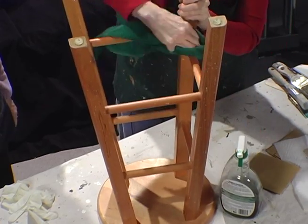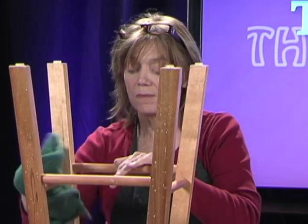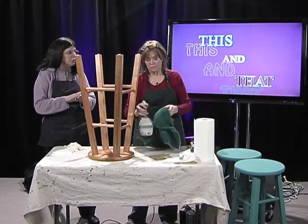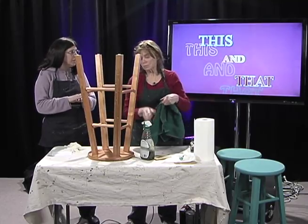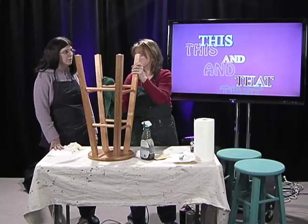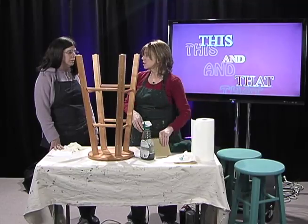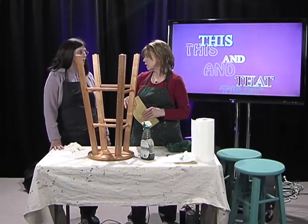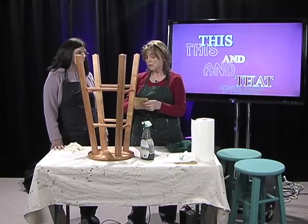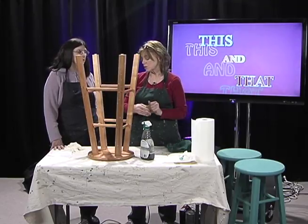It dries really fast, so then you should be able to take your sandpaper and lightly sand. There are different grades of sandpaper. If you're stripping your piece of furniture, you want to get as low a grit as you can, usually around 60 grit. But for this we're using 180 — I usually stay in the 180 to 220 range. It's relatively smooth, not real gritty. If you use 60 grit, you have to go over it with something finer, so you may as well just start with 180. This stool isn't heavily damaged, so there's not a whole lot we have to do.